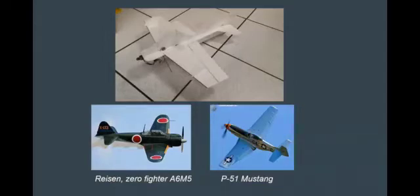The design of the plane was chosen to be inspired from World War II era warbirds and dogfighters, where propeller engines were still used, and we found it apt for our own plane. The straight lines and rounded edges of the propeller mount drew inspiration from the Imperial Japanese Air Force's top plane, the Zero Fighter. Straight leading edges and tapered wings came from the P-51 Mustang, a renowned plane in the war theatre as well. The tapered wings increased the aspect ratio of the wing in our plane, improving the lift. The smaller wingtip also decreased induced drag by reducing the size of wingtip vortices where the lower air mixed with the upper surface air.